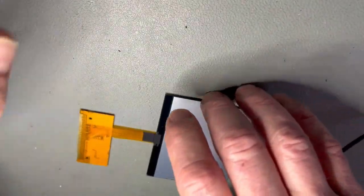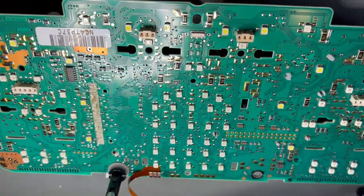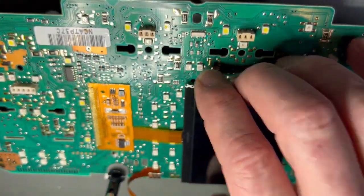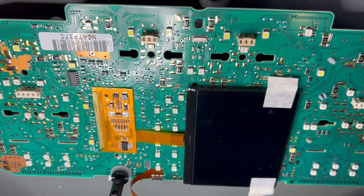I'm using an anti-static grounding strap here — good practice. Now position the board back and lay the display very loosely where it needs to go. The trick here is to solder one or two of the end pins in first. It's really important to make absolutely sure that the pads are aligned between the board and the ribbon connector — they're only about half a millimetre or a millimetre between centres. If you get the thing slightly misaligned, you're absolutely going to open yourself up to short circuits between the pins and bad connections.